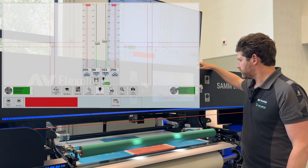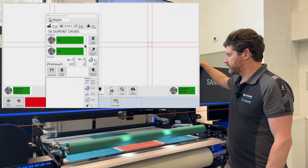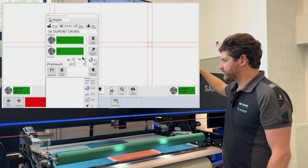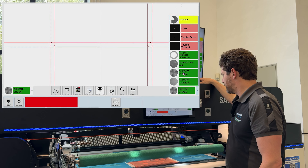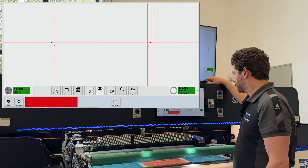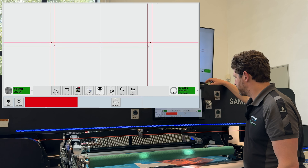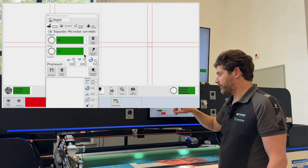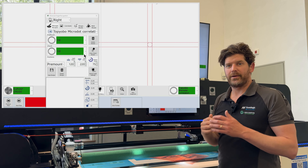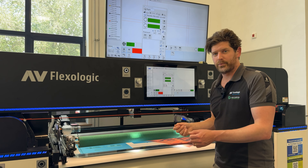The light intensity is also set in the image recognition recipe. For this specific situation, the backlight intensity is 255 — that's almost maximum. But when I go to another recipe, for example the micro dot for Toyobo plates I was just showing, the light intensity is 120 from the bottom and 220 from the top. So you can really play around with that and make sure that whatever plate you put underneath the cameras will be recognized automatically by the system.